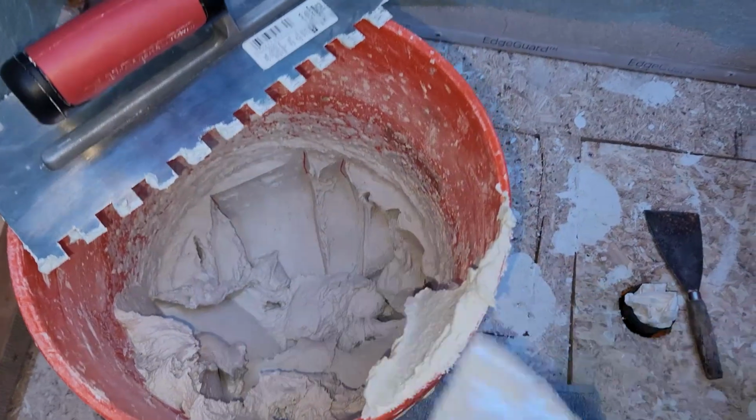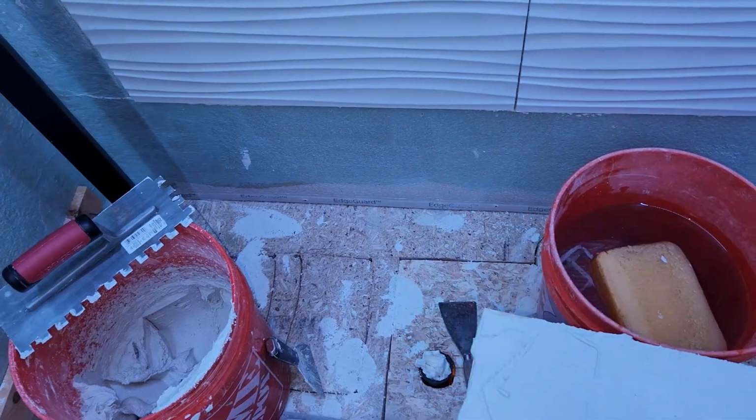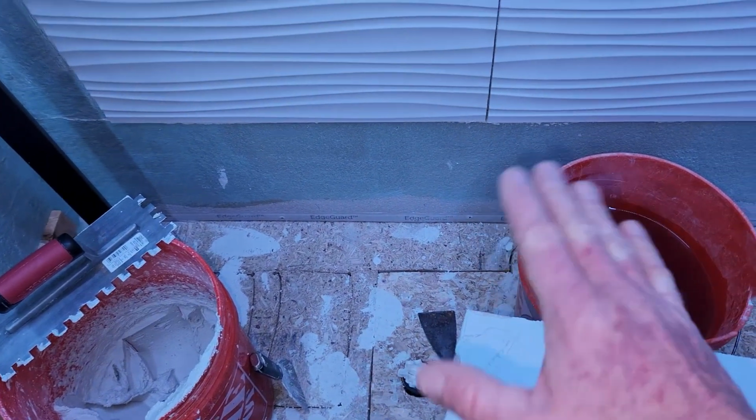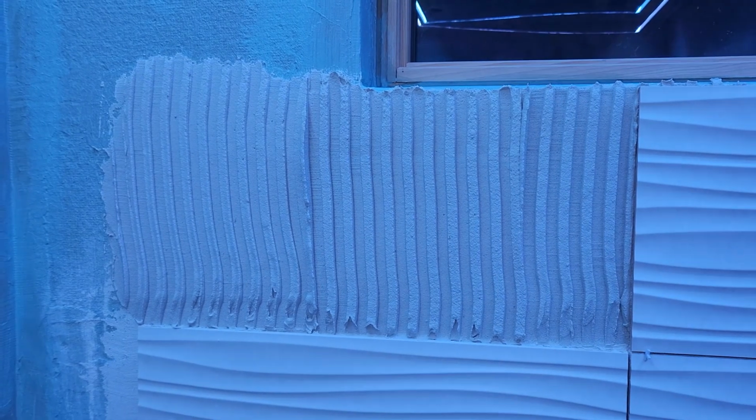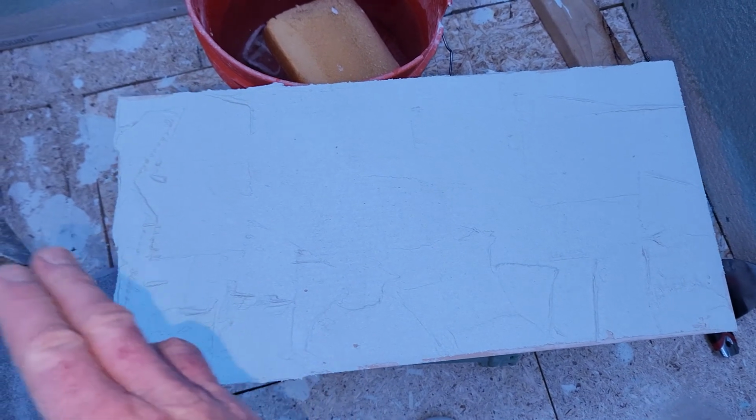So the first batch, I was already pretty dirty. A lot of splotches on the floor, of course, as you can see, but I wiped it up. So that's just flat splotches. A lot easier to work with this go around. Less cleaning of my grout edges. I really like it a bit thicker. So definitely do that. Secondly, again, back buttering, just a thin coat.